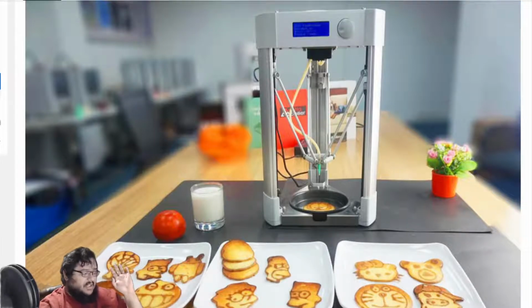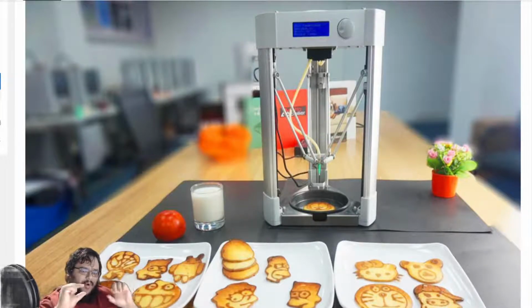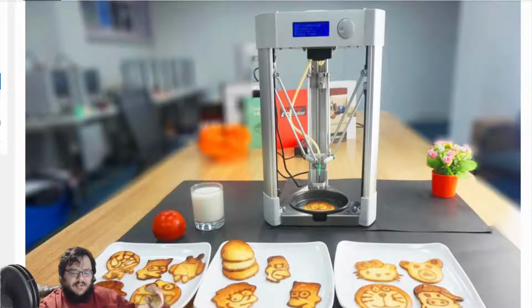I was supposed to post it. Man, try saying that a few times fast. I was going to post it a few days ago, but life. That being said, we do have it. I'm going to be posting a video, basically a short tug of war between a relatively decent pneumatic coupler and a compression fitting on a Capricorn Bowden tube. They're going to wear away the Bowden tube in different ways, and you're going to see why I prefer one over the other, and why compression fittings seem to do better in my testing than pneumatic couplers do. We're not even going to worry about Bowden collets, because Bowden collets are just cheap pneumatic couplers that are more of a pain to replace.